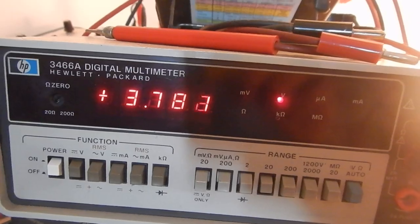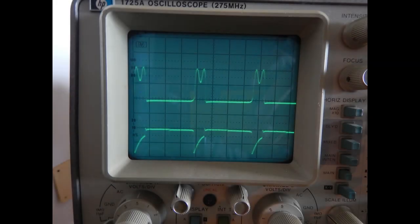A bit less than 4 kilovolts. And the lamp is much dimmer visually. Also, the collector waveform shows the sweet double peak. Of course, the peaks reach barely 100 volts because of the series lamp. The bottom trace shows the base drive waveform.